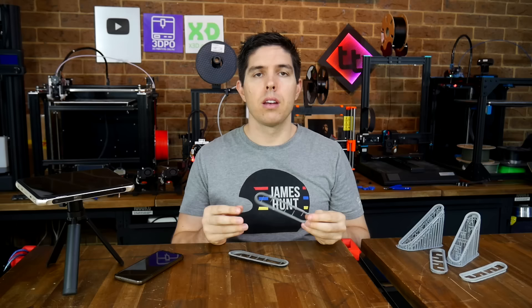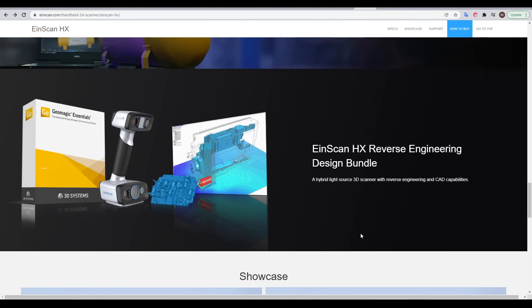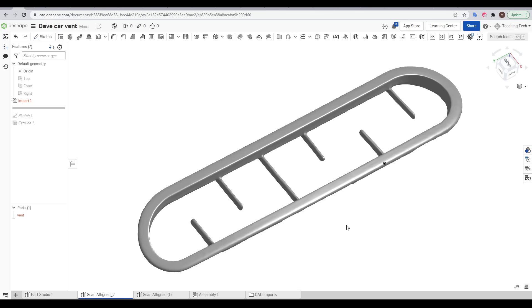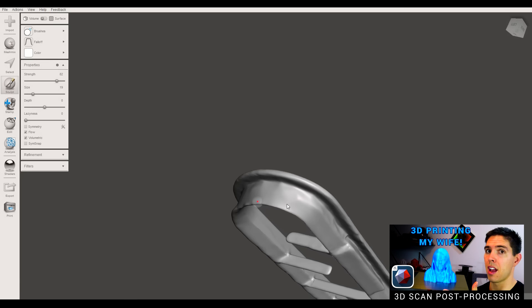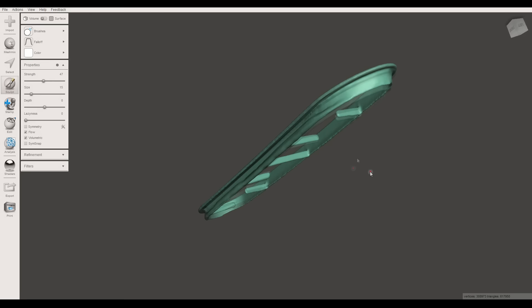What we've got is viable, but now it's time to improve it with that last 20% of effort. The EinScan HX comes with a reverse engineering software bundle including Geomagic Essentials, which analyses a mesh and converts it into editable solid geometry. Miles produced a STEP file that we can edit in CAD. I made a series of shapes used in Boolean operations to clean up the edges and fix where the clips attach to the dash. Finally, I exported as a mesh and used Meshmixer to smooth out surfaces that needed it. From the top it's pretty close to perfect, and I've restored the sharp edges needed to clip into the dash.